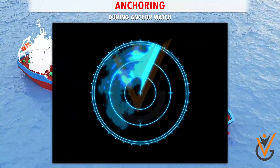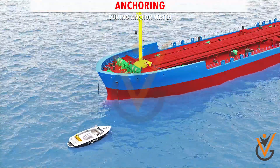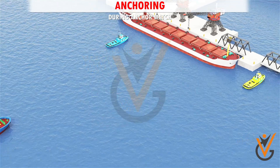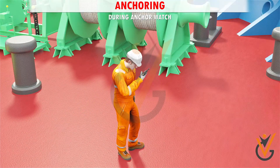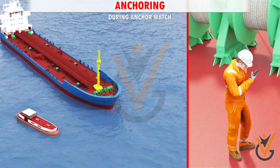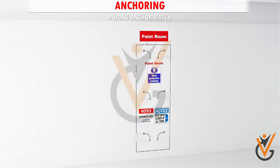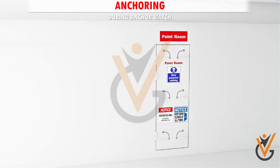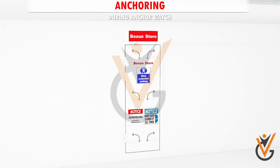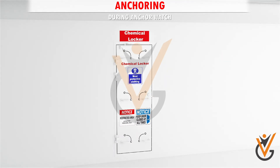Three, if it is observed that other ships or your vessel has come closer to the shore or other vessels, immediately report the same to the duty officer. Four, report all movement of crafts coming within the vicinity of your vessel. Five, keep a strict anti-pilferage or anti-piracy watch and ensure all stores, lockers and accesses, if not in use, are locked as per the requirements of the ship security plan.